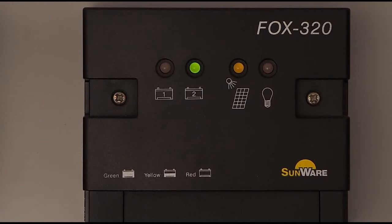In 60 seconds, the power supply of the consumers at terminal OUT will be disconnected to prevent battery deep discharge. Once the consumers are turned off, battery 1 recovers quickly and the LED lights yellow. The red blinking LED of the discharge protection indicates that consumers were turned off. When battery 1 is recharged and the charge level rises, 60 seconds later the consumers are automatically supplied with power again.